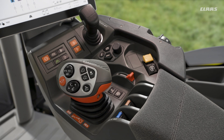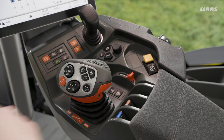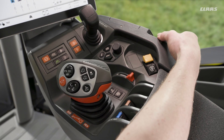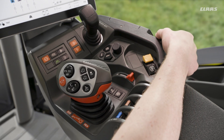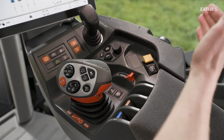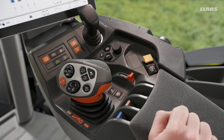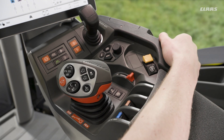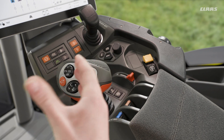These are linked to our maximum height and a working depth. So how do we set these? We have our depth wheel over on the right-hand side of the armrest, where we can choose our working depth — maybe 20% if we want to keep a fixed height, or all the way down to float if we want the implement to follow on the packer roller, for example. We can then adjust this on the move and fine-tune it while still in the work position.